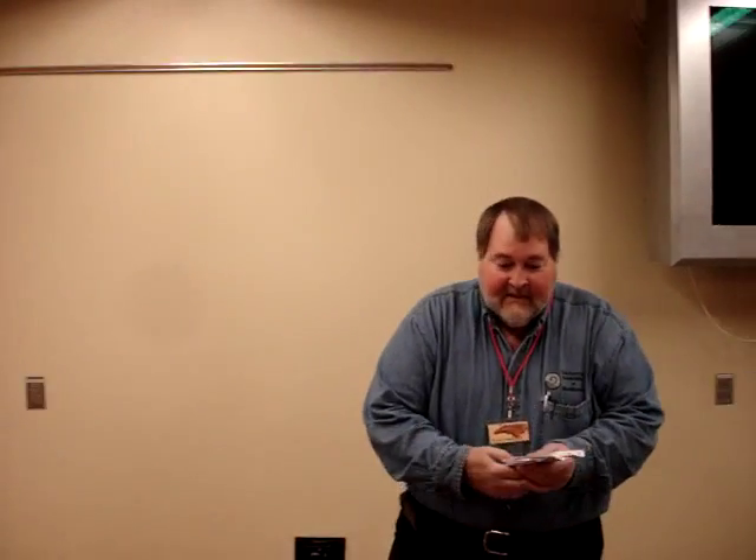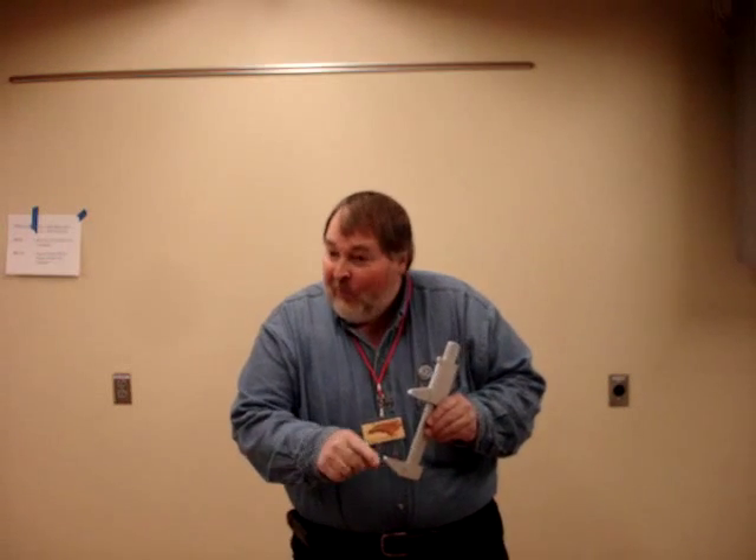I have three items tonight. This is a caliper — it usually comes two feet long and is pretty useless at that length. So I simply chopped it off at nine inches, and that works really well for most things like tenons. It's easier to handle, and I'm not worried if I drop it. I ground the points. If you're doing a tenon, you put it right down on the chuck, measure the tenon, and then you can put it on your wood. Most people use these with the lathe turning on the backside — don't put your thumb in front of it, because if something catches it can really hurt your thumb.